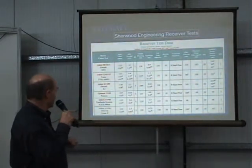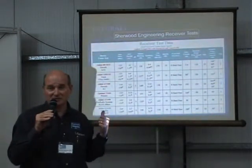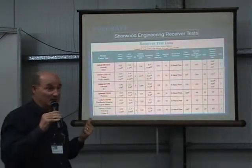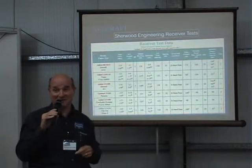And the little KX3, with the little baseband roofing filters that we designed for it, we'll talk more about this technology tomorrow, allowed us to get very good dynamic range on a little portable radio. Actually 104 dB at 2 kilohertz spacing. It shocked people a little bit. And also a very quiet local oscillator too. So we did a few better things there as we got better.